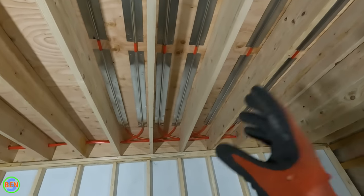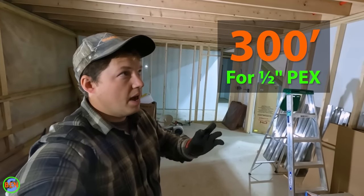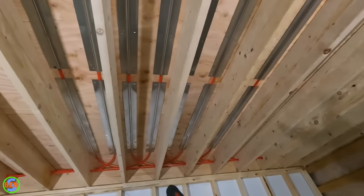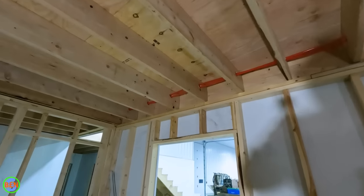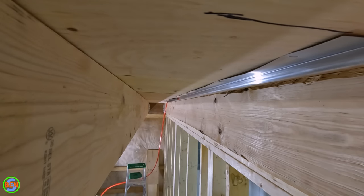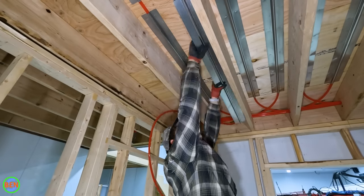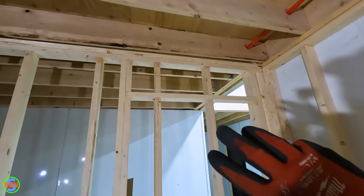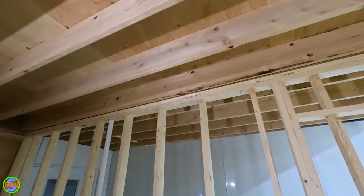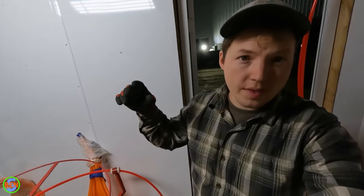This loop is now complete. We've reached the limit of what we can do with half-inch PEX — we're only supposed to go about 300 feet per loop with half-inch PEX. As we pulled each one of these out we were able to check how much we had pulled off the roll and once we reached about the right amount we quit. Now we'll have to repeat the same process for the area that still needs tubing, which is going to be basically identical. You will have additional tubes running through these same holes so make sure you take that into account when drilling — how many loops are you going to have to bring through? Down where we're going to have a third loop I might have to drill some separate holes on the opposite end of the joists. Once this loop is completed we're going to line it up to the length we need and cut it off and move on to the next loop.